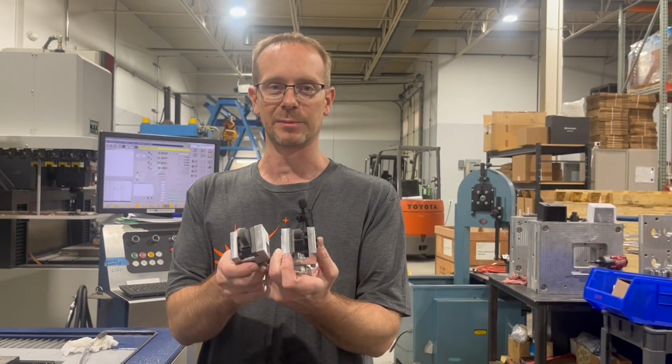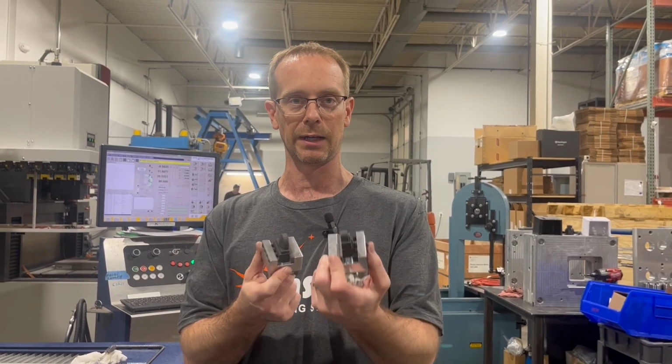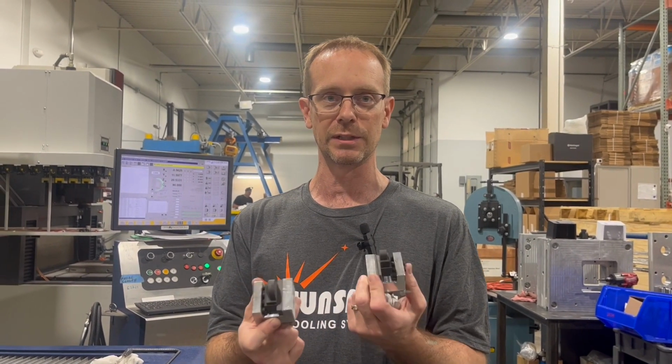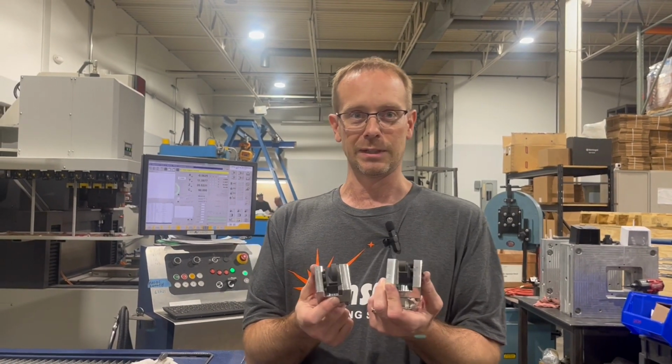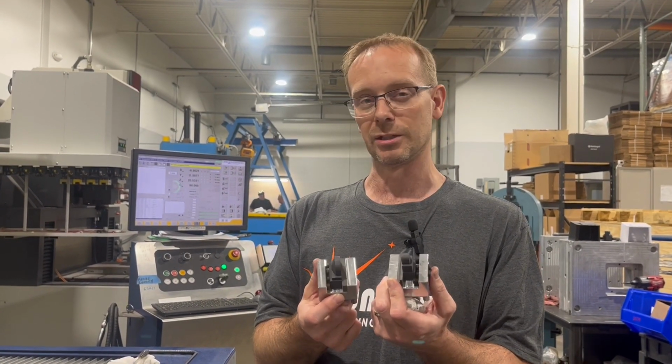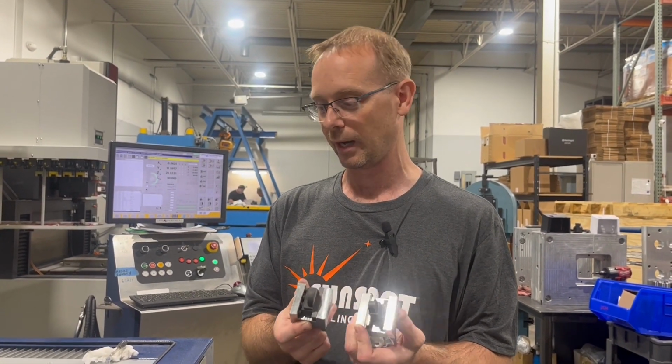For accuracy, sometimes people don't want to have the error of your machine rotating or the way you've cut it. It depends on how good your machines are at holding your 0 position. So that's one of the reasons we didn't do it on this particular one, but that can be done, and it should be when you have the chance.